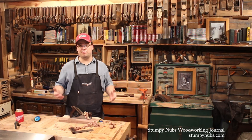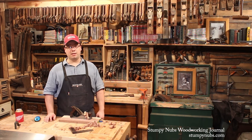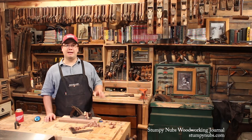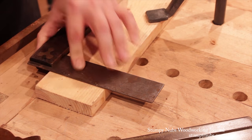I'm going to show you all the things you can do with a marking knife and an awl. Pencils are great, but they just make lines, and unless your point is super fine those lines aren't going to be terribly accurate. A marking knife and an awl are far more accurate and much more versatile — not just for the reasons you may think. Their razor-sharp point can get all the way up to the edge, and they leave an actual physical reference point in the wood itself which you can use as a guide for your tools.